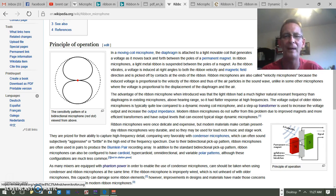That's a simple way to understand it without getting into the technical aspects. For the applications we're using, we need to keep it simple: the velocity of the ribbon moving back and forth produces the voltage. It works along the same lines as electromagnetic induction in the dynamic microphone, except the ribbon moves back and forth between the actual poles — not touching them — and its velocity causes the electromagnetic induction, with higher velocity producing higher voltage.